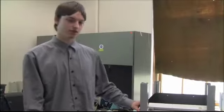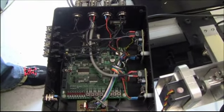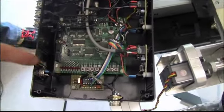Okay, the microcontroller system just consists of the Atmega 128 board that we use for everything here at Oregon State. We're mainly using the UART interface for PC communications. Down here you'll see the analog to digital converter. That's all done through SPI on port B. And all the other connections go to the motor control unit.